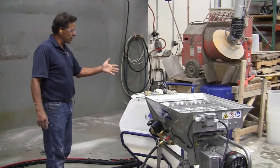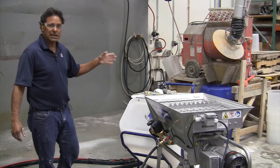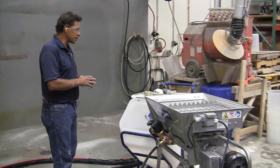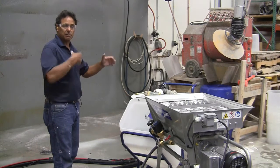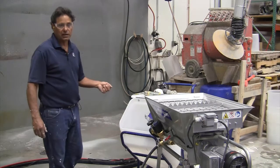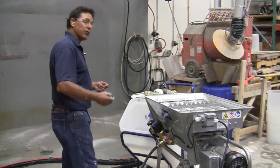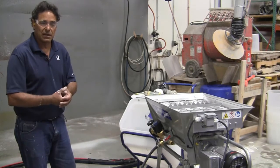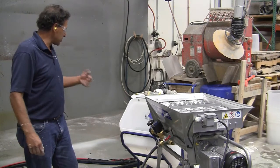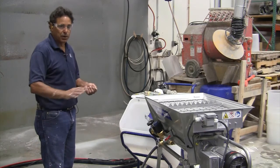Why is this pump better than the other small pumps on the market? This is the first of its kind — it is a piston pump. Piston means you can get much more pounds per square inch pressure out of a given power system. We can get 600 PSI out of this. A typical rotor-stator, which has been used in the industry, will produce approximately 300 PSI. What does that mean? Further hose lengths and the ability to go vertically. I personally have gone 150 feet out and 60 feet high with this configuration and it pumped beautifully.